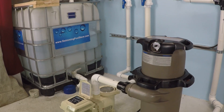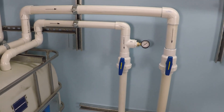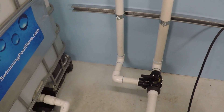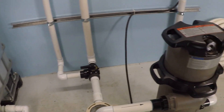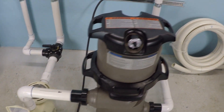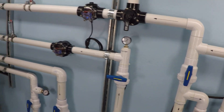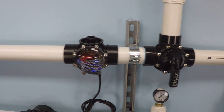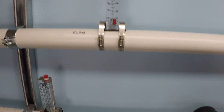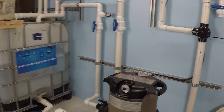Let's take a quick look at the system. This test is utilizing two suction lines — one inch and a half, and one two inch. The inch and a half is almost inconsequential; I could close it completely and hardly change the flow values. Ultimately, this is a two-inch test, because after the pump and this 150 square foot cartridge filter — maximum design flow rate 120 gallons per minute — I'm sending all the water through the two-inch system and through the flow meters. I have an analog meter with a digital upgrade, plus a secondary analog meter for redundancy.